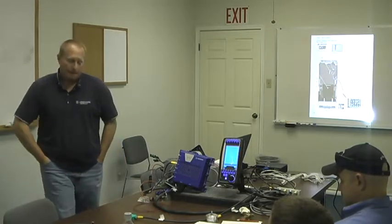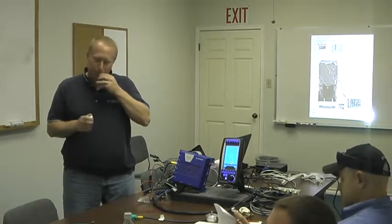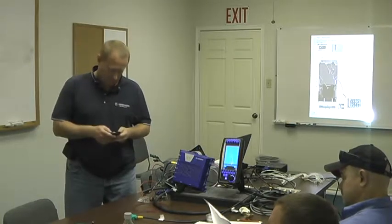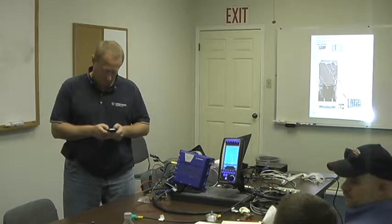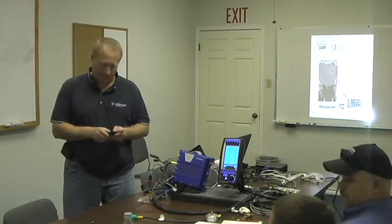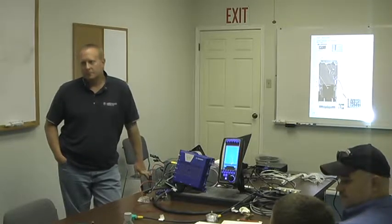One of the things that Charlie didn't talk too much about, as far as power and ground these days, what do you got, a 50 amp fused connection to ignition or power? Yeah, we've certainly increased the level of power capacity for the crane. We're providing power through like an 8-gauge wire now. We have three separate power circuits. One is crane power. One is for battery power to make sure that the LMI stays in its proper startup sequence and shutdown sequence, and the heater. And then we also have cab power, and all three of those are on 3 separate lines. 2 of them are number 8. The third one I think is number 10. So if you start plugging in your coffee maker and stuff like that upstairs, it'll still handle quite a bit of current up there.